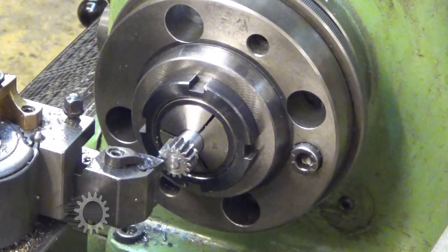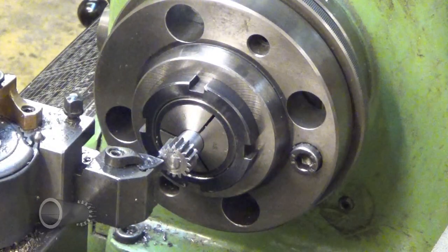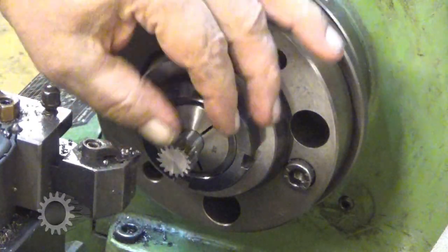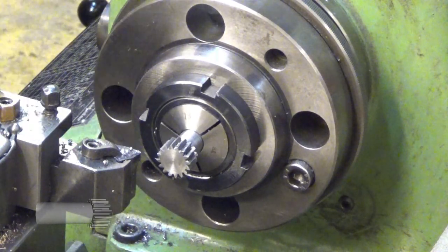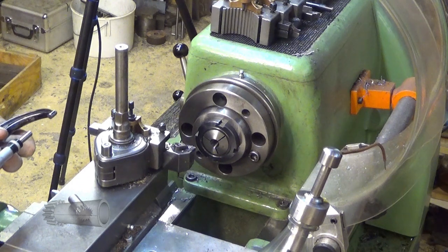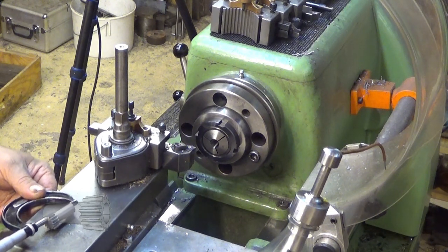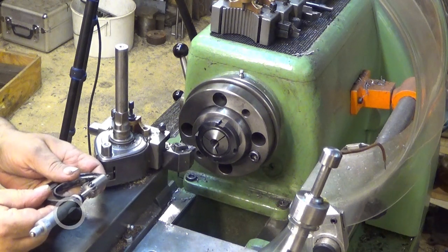Now the longer pinion in a 13 millimeter collet, and I will first clean up this face. It's disgusting. I will take it away, measure it, and look how much we need to peel off. Let's see now. 40 millimeters should be the total length. So that was 30, that's 40. Now it should be 40.5. And it is. Yeah, it is 40.5.